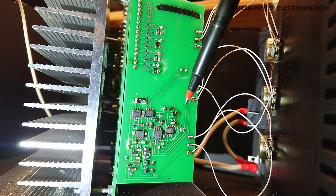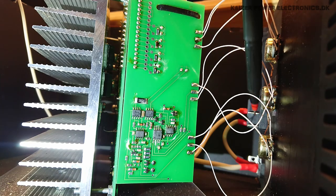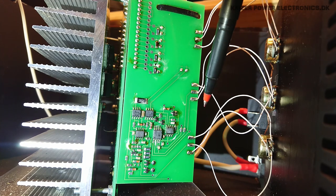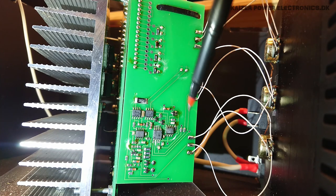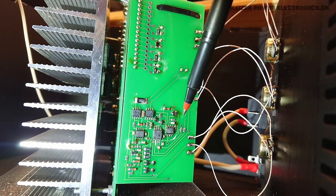That it uses a current transformer feedback on the primary circuit could also explain why we have a third potmeter over here, that there would be some kind of startup oscillator needed in order to use a primary feedback on a non-resonant primary circuit as it is in a solid-state Tesla coil.